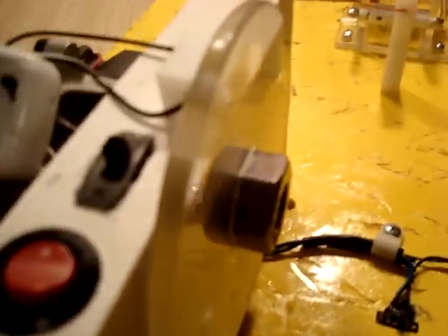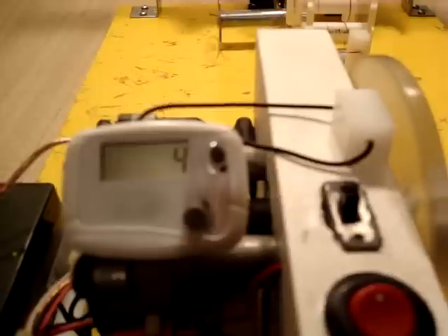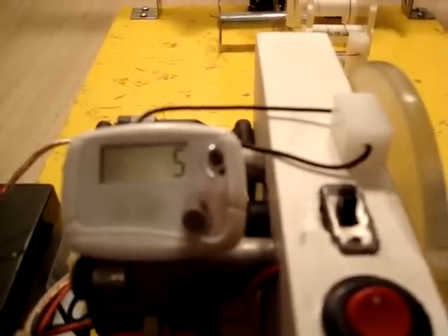There are three retaining bolts that hold it through — you can see them through the disc here. Now let me show you how the counter works. Every time the magnet passes by the reed switch, it changes our pedometer reading. I'm going to turn this on — you'll see the magnet passed, so there's one, and there's two. It works very, very well. It doesn't have any miscounts or miscalculations; I've been running it to verify. I took it up to about 500 turns and it was still going just fine.